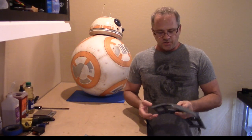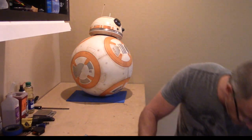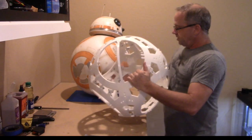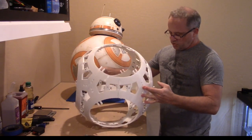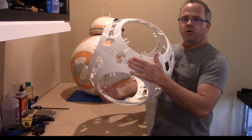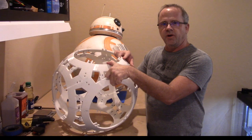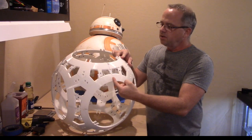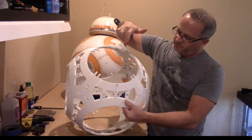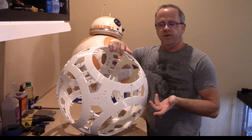But the more I looked at not only my original designs but all the other designs out there - with exception to the aluminum ones - this actual joint, when you roll the sphere and the axle point goes from here to here, you inevitably roll over this part right here. By definition, you have not only the skinniest portion of the sphere right here - so it's going to be the weakest - you also have a transition point straight across here, so it can crack easily. And most of the time your ribs are in this orientation, so you have no added strength there. It simply can crack if you put enough pressure, especially as you go to a thinner and thinner design.